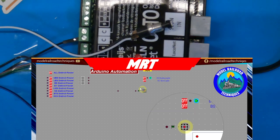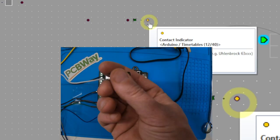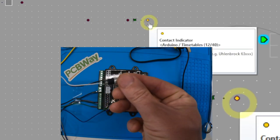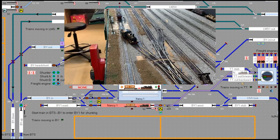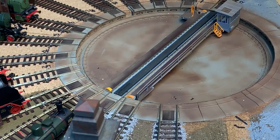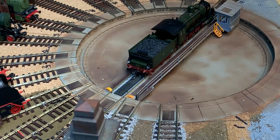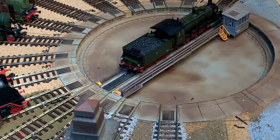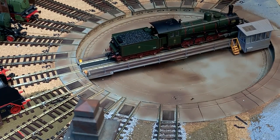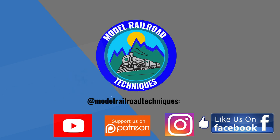Going back to the second button: the one on the right with a halo is constantly yellow. When I push the little red button you can see it turns itself off — that's the normally closed button, so pushing it breaks the circuit. That's the end of this — I'll implement it on my layout in due course for various functions. What I like most is being able to use real-world buttons and toggle switches to interact with your program of choice. Make sure you subscribe, click the bell icon, support us on Patreon, and like us on Facebook and Instagram at Motoraro Technique.